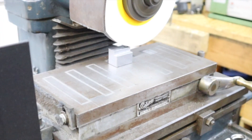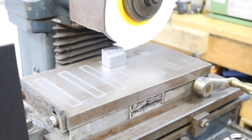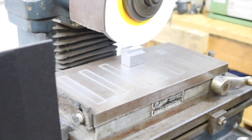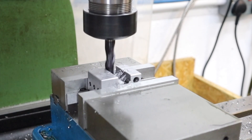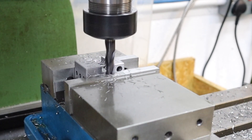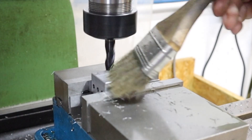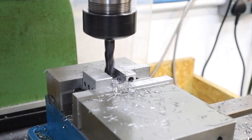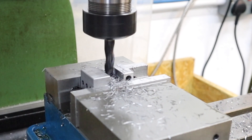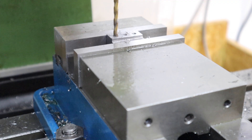Having had to use the parting tool instead of the slitting saw, we've actually reduced this clamping area on the end stop, so I'm coming back in and taking off a little bit more to account for the amount removed by the two millimeter parting blade instead of the 0.5 millimeter slitting saw.